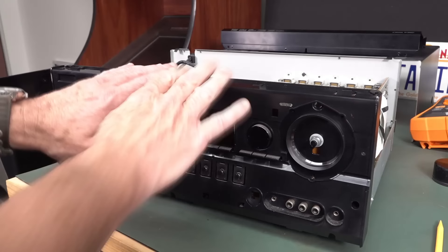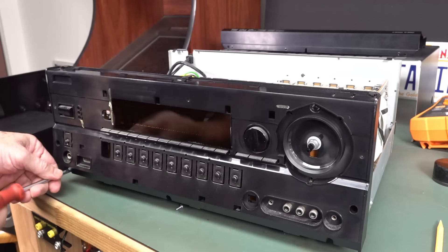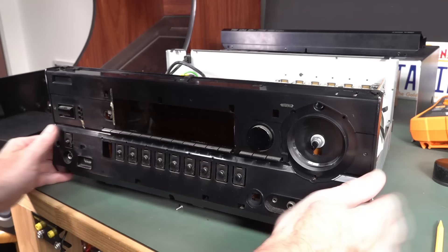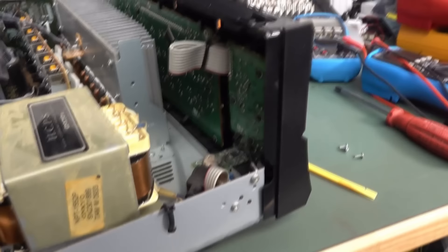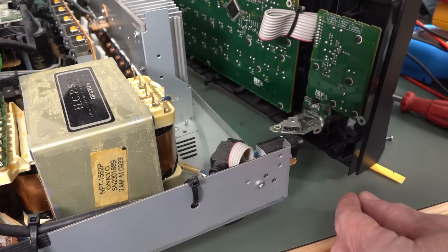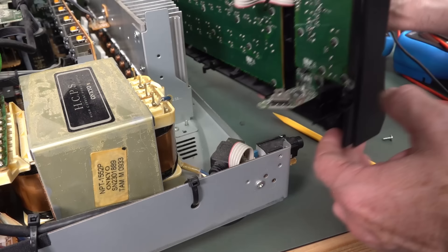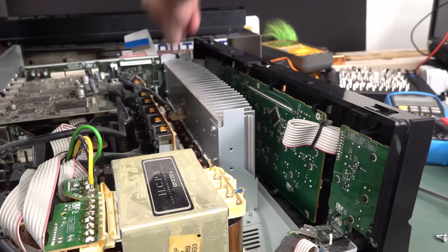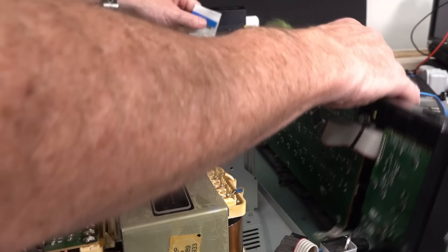You want this to be like a finished assembly with the board in place, everything else, and then you can assemble and test that on its own test station in the production line. Is there another sneaky screw in there? There's actually another three sneaky buggers on the bottom. There we go — now we're talking. Disconnect the HDMI. There's just one little annoying ground lead right there — get him off. That's just referencing the HDMI switching board, the HDMI receiver board, and then it transmits back through. There we go — we've got the ribbon cable on the front, over in that corner. And that's about it. They put tape there holding that in place — nice touch so it doesn't get pinched when you put the metal case on top. Always remember when you're designing stuff to tie your cables down. There's the entire front panel assembly — we can now work on that.